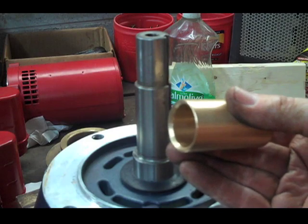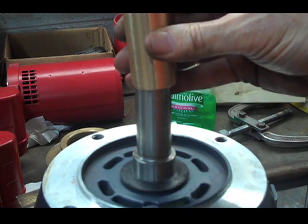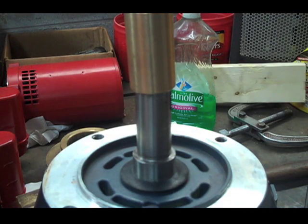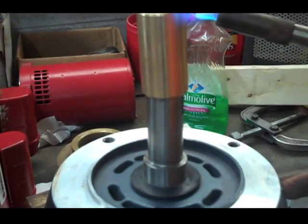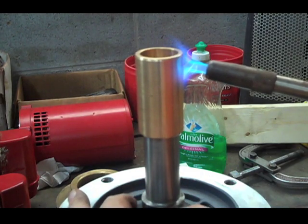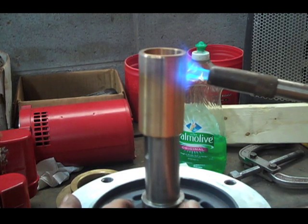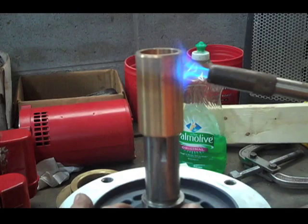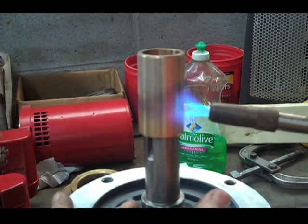You'll notice there's a beveled side and a flat side — I like the flat side up toward the impeller. We're going to put that on there and cock it to one side so that it cannot fall on its own. Then we are going to heat this thing starting at the top. We do not want this to fall until it is really hot because it will stick. Turn it and get the heat all the way around it — we're going to want to make this change colors. We do not want to heat the shaft; we just want to heat the sleeve.